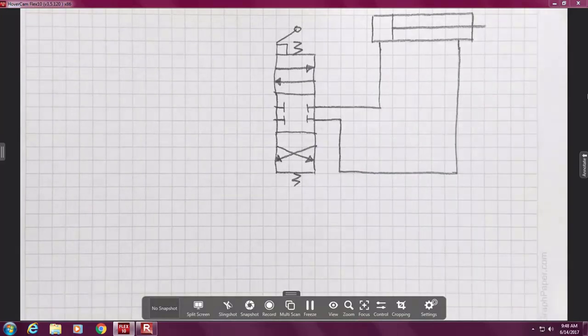Now, Charles, one of the things that I'm going to add that your first drawing didn't is where is the power supply? Where is the pump, the relief valve? Because that's usually part of it. The amateur lessons will say, oh, just draw the manifold, those four ports where you hook the hoses or the return. Okay? But we want to draw that in.